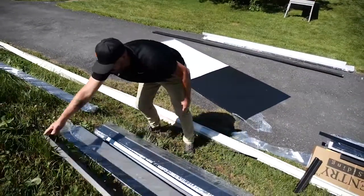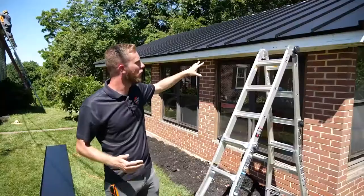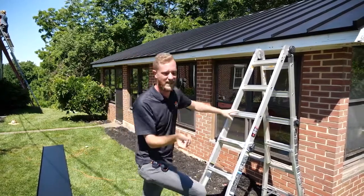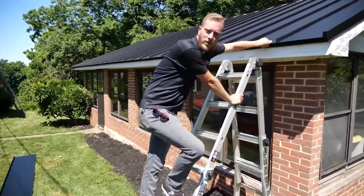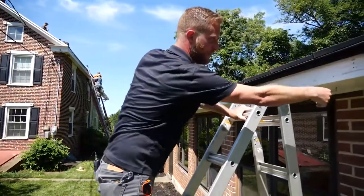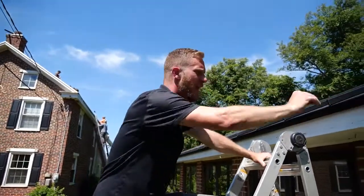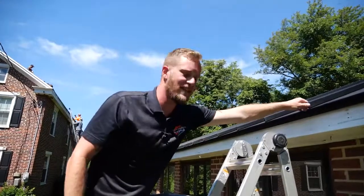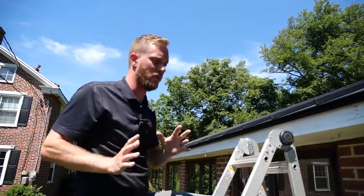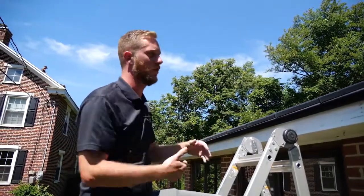It all comes in a nice plastic wrap. Here's the final product — the results speak for themselves. It's beautiful, sleek, modern, and it's going to last forever. These are the final details we love about standing seam metal roofs. All the hems are completely folded over. We're about an inch off the fascia board so when water comes down it cascades down your drip edge, and we leave room for gutters eventually. Every single little area is closed off — nothing is getting inside the end of these panels. There's a level of craftsmanship that goes into these metal panels that sets it into a totally different category, a totally different stadium from asphalt shingles. While you're going to pay a little extra for these, the results speak for themselves.